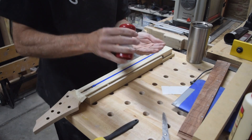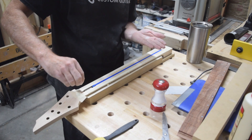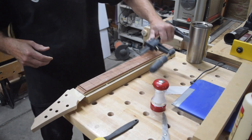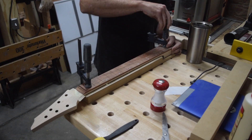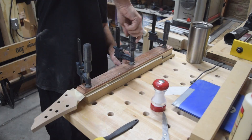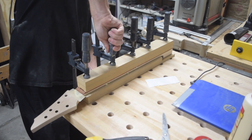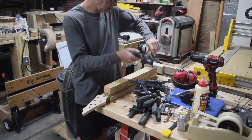I'll remove the masking tape since it isn't needed anymore, and I'll do the old woodworker's trick where I'll grab a pinch of salt and drop a few grains in several spots along the surface where the fretboard is going to be joined. Then I'll place the fretboard into position and use my adjustable clamps to temporarily clamp it down — just to get the glue to initially set up, which takes about three to five minutes. Once that's done, I can remove those clamps, place my clamping caul onto the surface, and really start ratcheting down a whole mess of clamps to get that fretboard bonded consistently with no gaps.